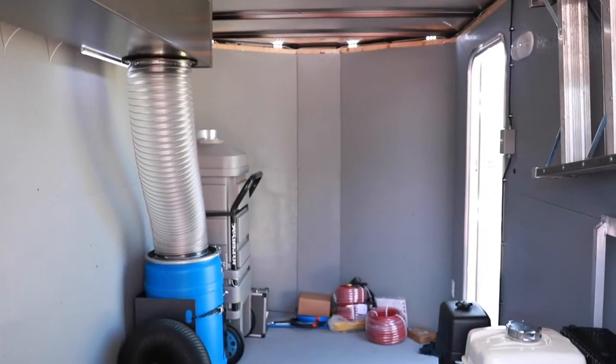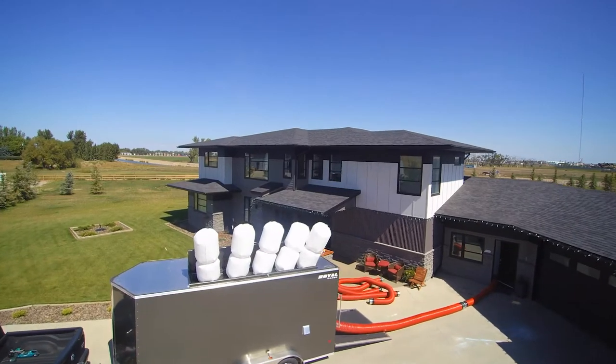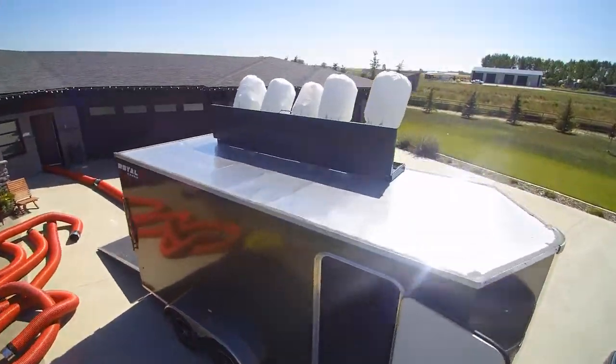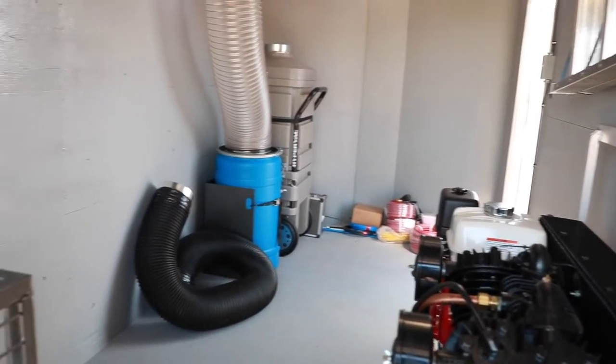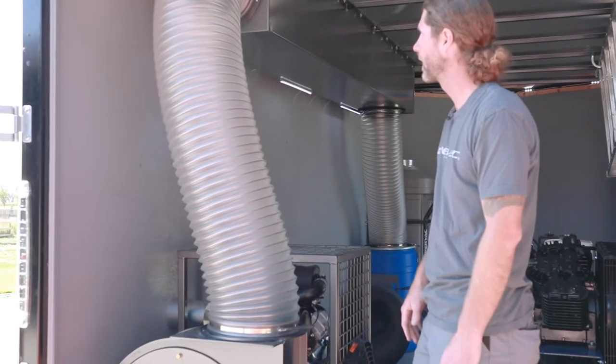The new H1 actually blows all of its debris down into an easy clean-out bin at the very end of the trailer, and all the bags blow at the roof so there's no dust buildup inside the trailer. It's all being blown outside into the filter bags. With all the other trailer systems, you've got all the dust being filtered before the fan, which typically doesn't give you near the suction as a positive displacement fan system like this style does.